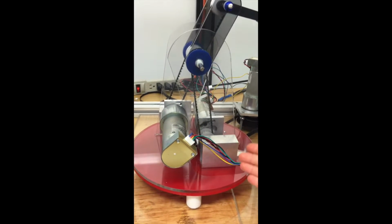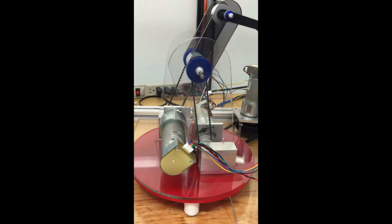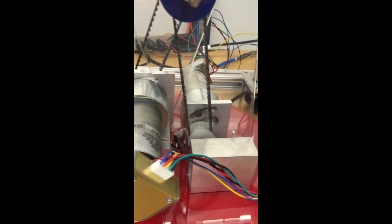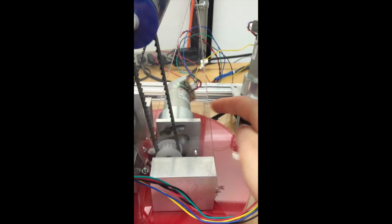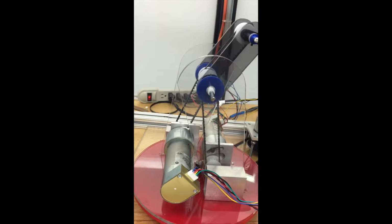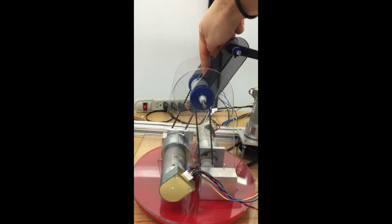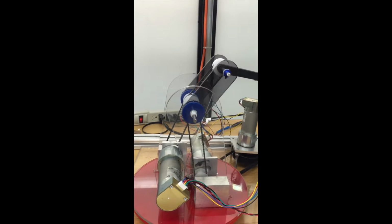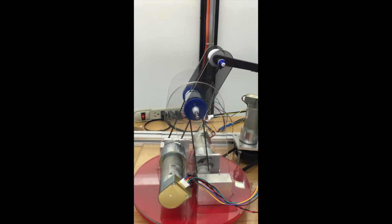The laser-cut acrylic base arms of our robot sit directly on the turntable and are supported with brackets. The 2 motors, which provide power to actuate arms 2 and 3, are mounted between the base arms. The base arms hold shaft 1, which is actuated by a belt and pulley system attached to one of the motors on a turntable and acts as a second revolute joint.